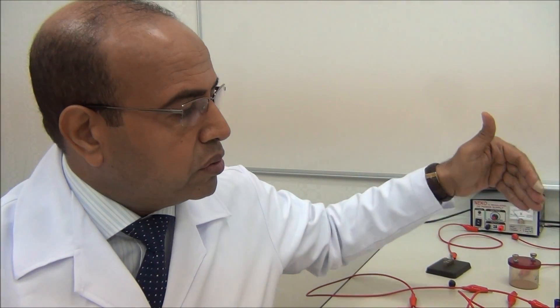What is the conclusion of this experiment? We did this experiment to verify Kirchhoff's first law: at any point in the circuit, the sum of currents in equals the sum of currents out. I1 was 0.18 amperes, and I2 plus I3 was 0.26 amperes — 1.4 times more than I1. Why is it not exactly the same? Because we have many connections of wires, so we have not only three resistors but also many other resistors. So approximately, we verify Kirchhoff's first law. Thank you.